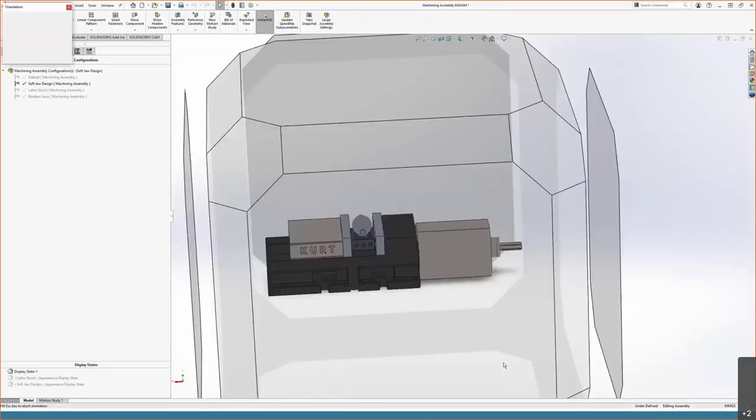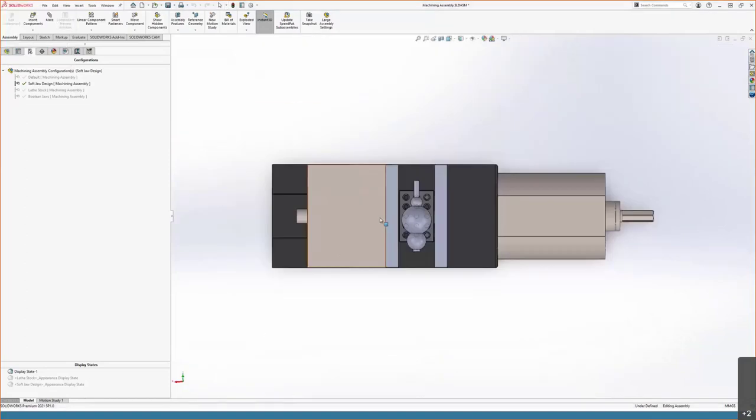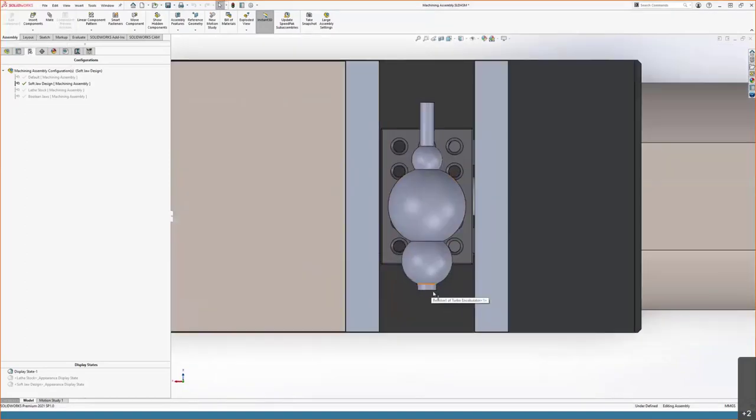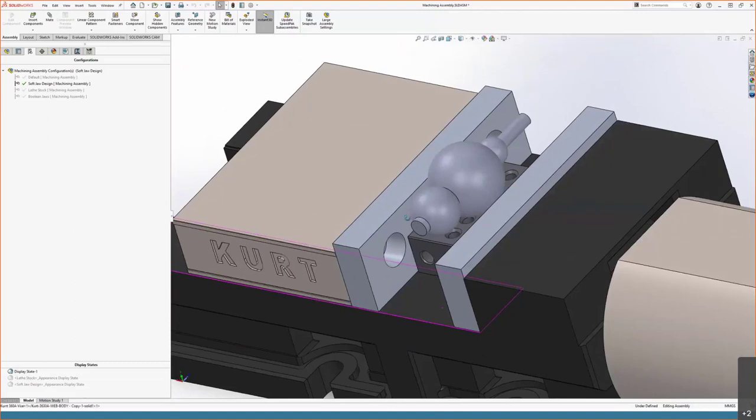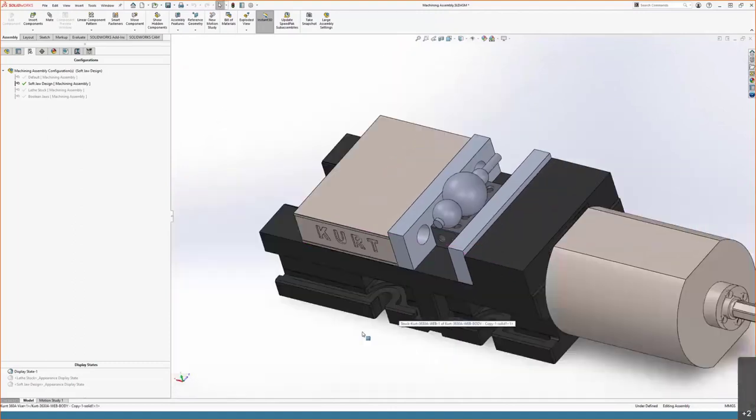It would be a bit of a bummer to go through all of this work to design our faces and only find out that we're clamping a 1, 2, 3 block instead of the actual work. But with cylindrical parts on a mill, that's kind of a solved issue. We can use V blocks against the moving face and push the cylindrical part against the fixed face.